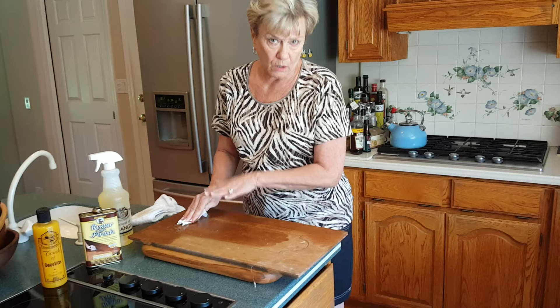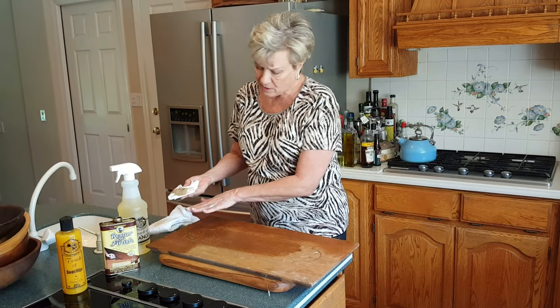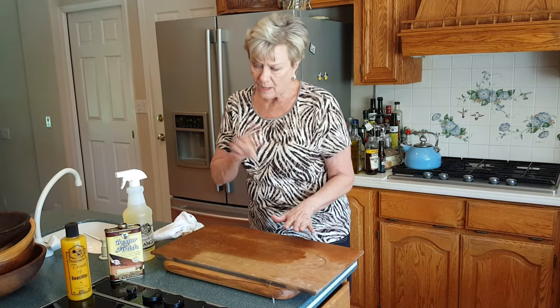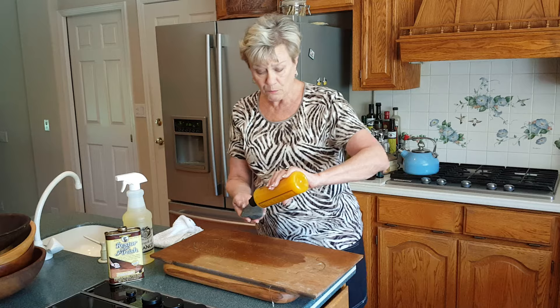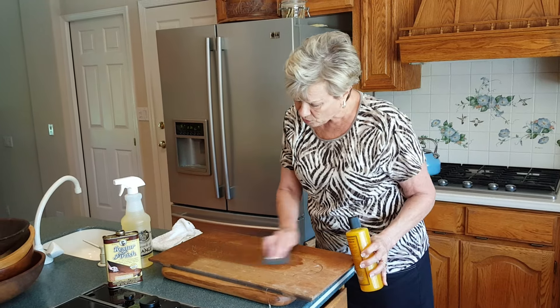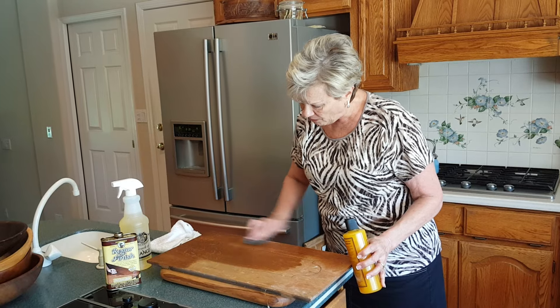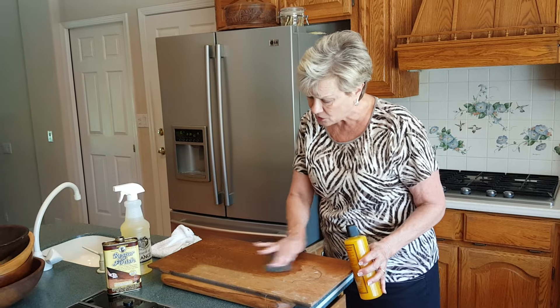Of course we need to go clean that center one first. Now that you've got an even color, you're ready for the finish — Touch of Beeswax. This is going to put that finish and put that moisture back into your wood. Use the 4-0 steel wool and go ahead and buff it right in those areas — those dry areas, water damage, steam damage.